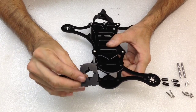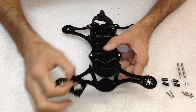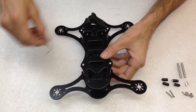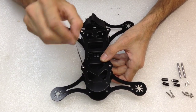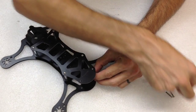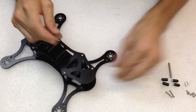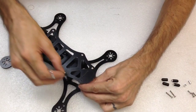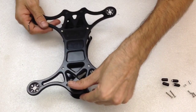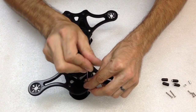Now take the camera plate. You'll see on the camera plate there are two slots on the bottom and one slot on the top — that's just how it goes, so make sure you've got it the right way. Get it in and get both grooves top and bottom seated. You can go ahead and snug those two screws down a little bit tighter, then take your front standoffs and slide those in next to your camera plate — do the top ones first. Take another eight millimeter screw and slide that in. At this point flip your quad over, take some eight millimeter screws, get in the bottom front standoffs, and lock everything down.